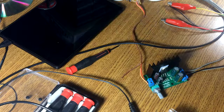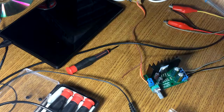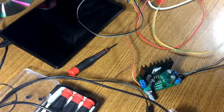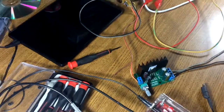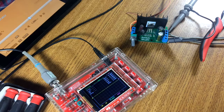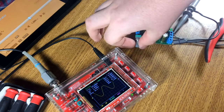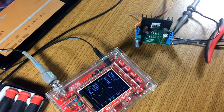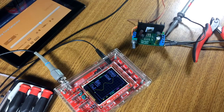Since it may blow bits everywhere, I'm probably going to hide behind a chair. What I'm going to do is have it hooked up to my 8 ohm dummy load, then grab a pair of jumpers and short across the output. I'll hook the scope to it as well just to see if anything happens. We're set up — got the power supply set to 21 volts, we have output. Let's go ahead and give it about half volume.